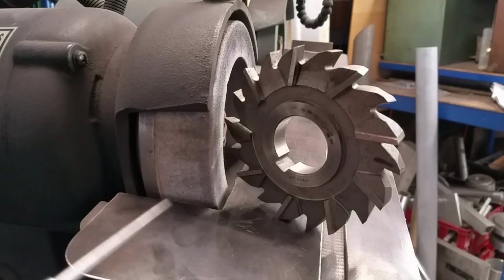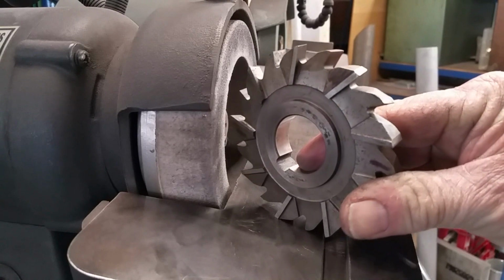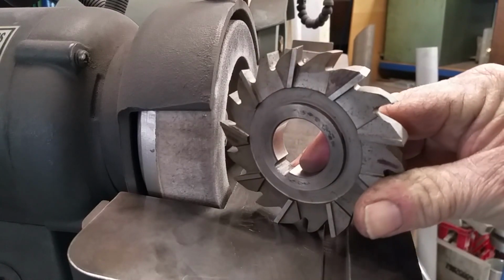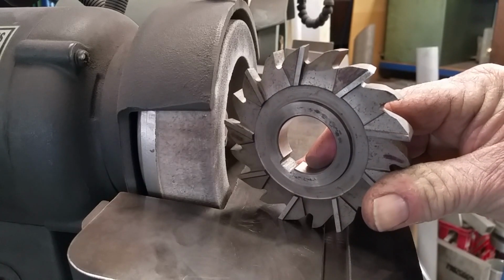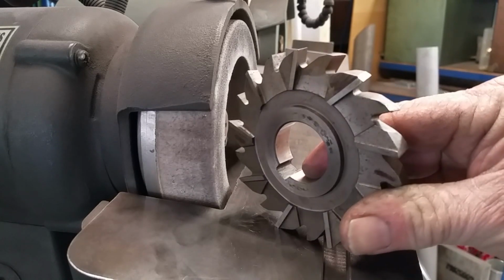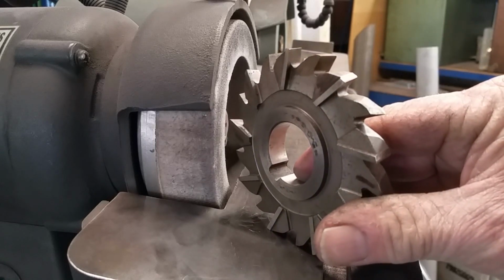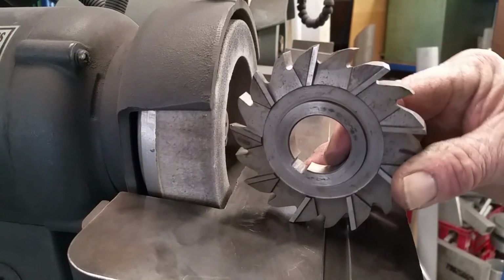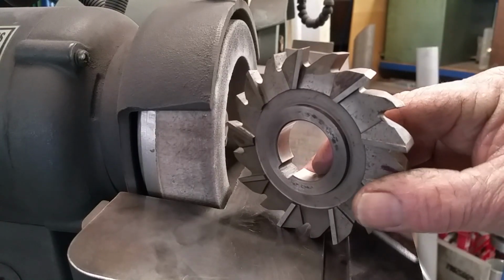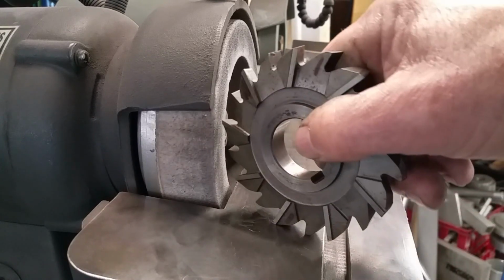The best way I can explain how I'm going to hold and how I'm going to guide this cutter. So I'm actually going to hold this by hand. I'm going to hold it down here, and I'm going to work this cutting edge like this. Of course, I'm going to put you on the other side, and I'm going to get in here where it's comfortable so that I can put two hands on it, because that's what it's going to take, is to actually hold that steady enough to work that back and forth like that. Actually, in an arc, you know, kind of working, you're going to work that radius all the way on both. Okay, and then we'll switch to this one, and we'll switch to this one.